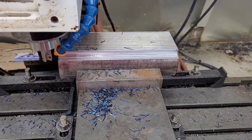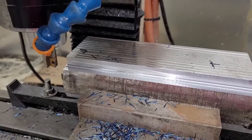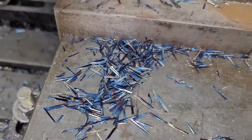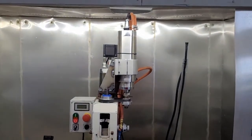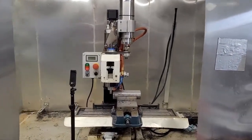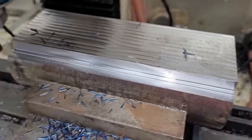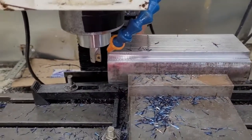Let's see how much our material removal rate is. Well, we just did the math on our calculator. Running the 80% higher feed and 80% RPM, and correcting for the fact that we thought we were going to do 0.42 inches depth but ended up doing 0.38 because that was too aggressive — these chips are coming off at 0.5 cubic inches a minute. Half a cubic inch a minute of material removal rate. That is awesome considering this is just a little PM25 with a large motor. It keeps getting better as we speed up. We only went up to about 4,700 RPM and this will go to 6,000. More RPM means it chatters less, you get better surface finishes, and tools usually last longer in terms of how much metal they remove before they die.